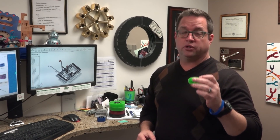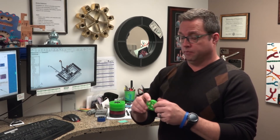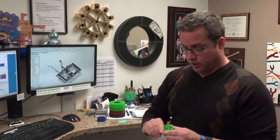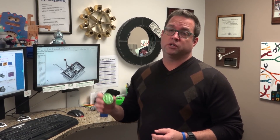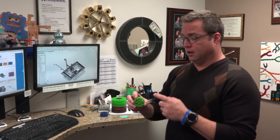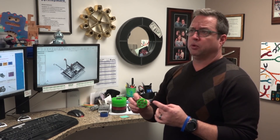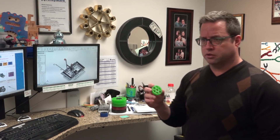This is a compliant wheel. We put two of these in everybody's kit. This is a pretty wimpy, very pliable, very ductile, very low durometer compliant wheel. All of our greens are around 35A durometer. It's made out of TPU, which is thermoplastic urethane. We have lots of different types — 2-inch green, blue, and maroon. The blue ones are the hardest at 50 durometer. The maroons are 40-45 durometer, and these greens are the softest.